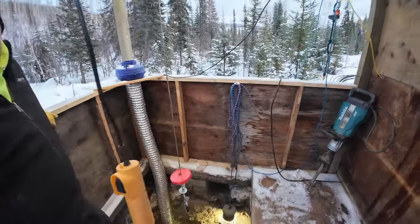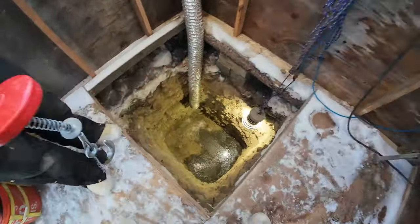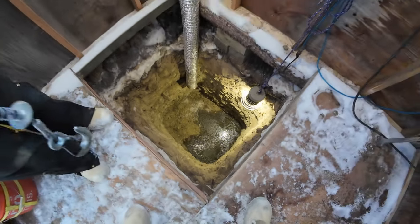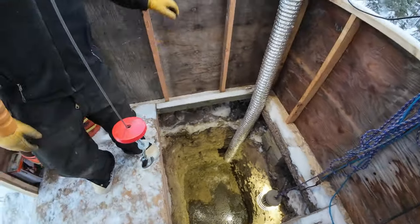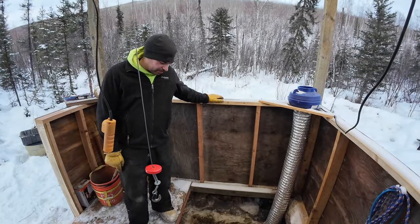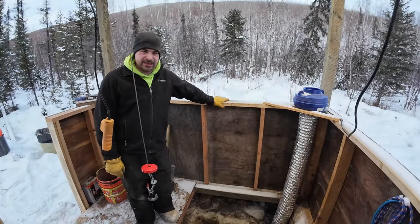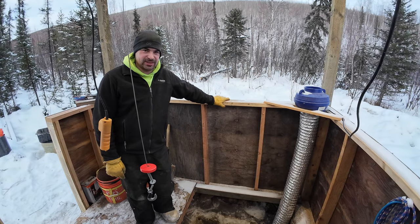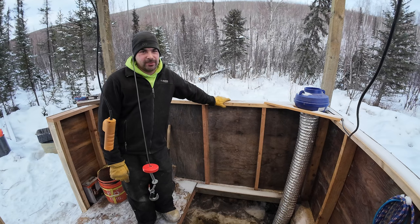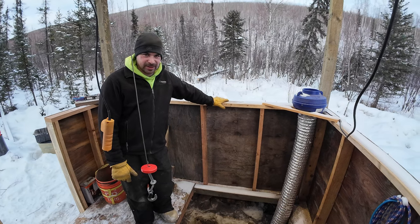Yeah. It's like the water has this thermal mass in it, and it is keeping the bottom of the shaft from freezing. So we're gonna have to dig a sump. We're gonna have to maintain that sump. We're gonna have to pump constantly while we work. It's gonna get a lot harder to dig in thawed stuff. The frozen is easy because you can just pick it up and throw it in a bucket. But we're gonna have to literally shovel sticky wet material the whole way down. It's not gonna be good.